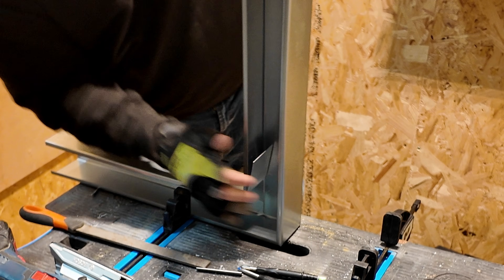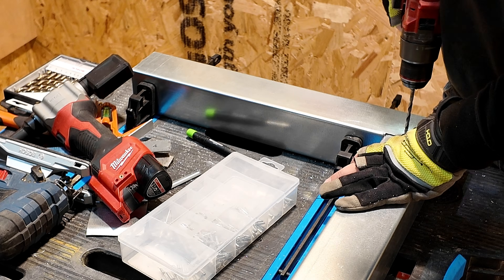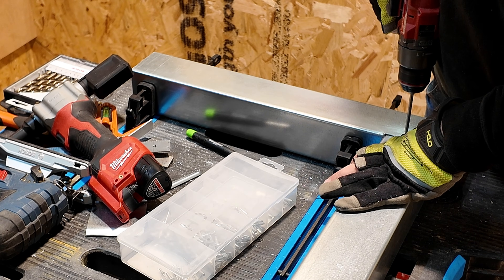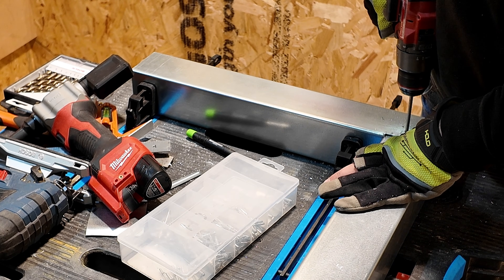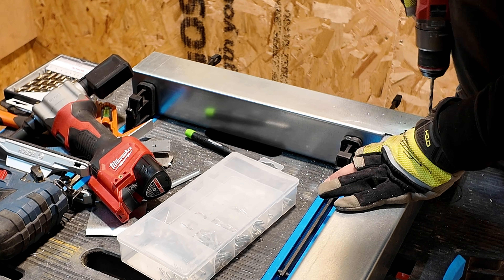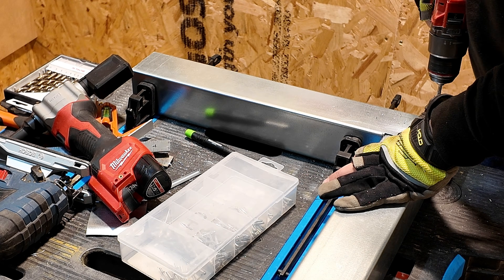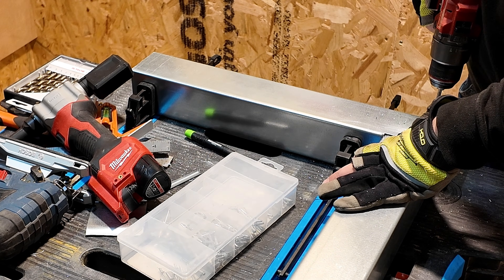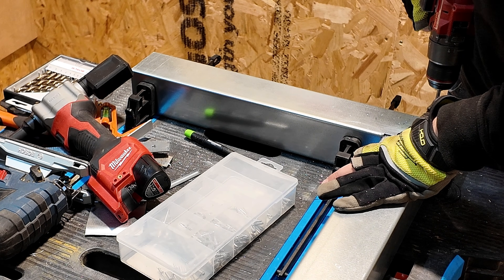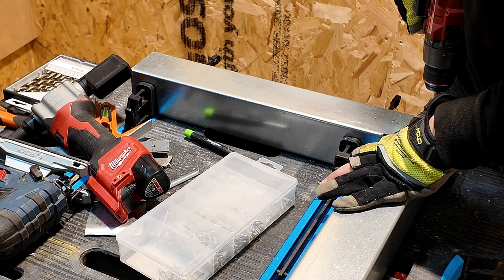First time out, it wasn't a bad result. You're never going to get a perfect bend on every single manufactured bend you make — it's just a case of trying to do your best. We don't always have time allowed on site for perfection. So here you can see I'm just popping some holes in the back edge first so I can secure that with some rivets. You can use nuts and bolts if you wish, but in this case I'm going for the rivets. They give a smoother finish both internal and external to the trunking, and allow for a neater profile off and on the wall.